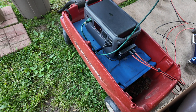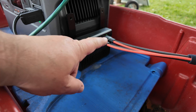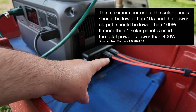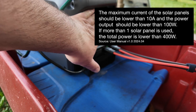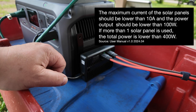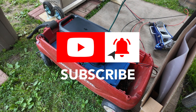What they don't tell you when they sell you these devices: you pay extra for the MPPT charger attachment, you can put two on there, but you can only use 100-watt panels — you can't go higher due to the voltage limit, so you can't run them in series, you have to run them in parallel. Also, when you put the second box up here, the fan gets blocked — that's another issue. But you can put six panels on there total, which will be nice. That's what I wanted to show you, and there will be more videos to come.